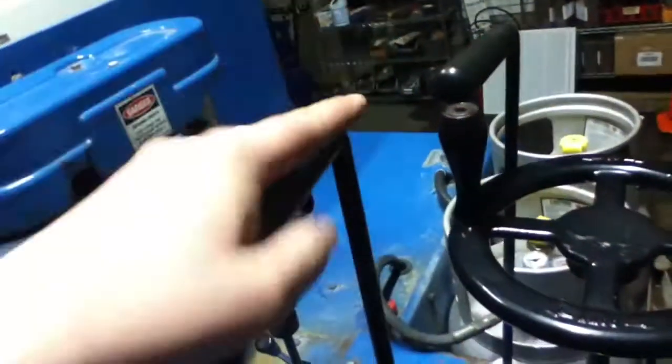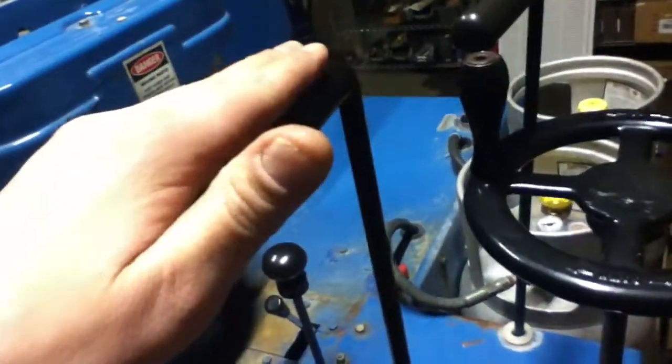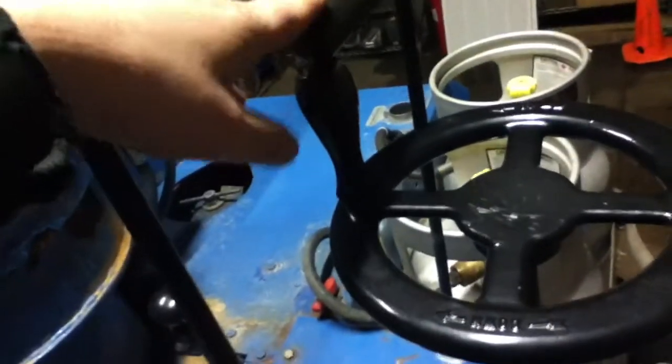And we'll go over here. Let me change my camera angle. We have a series of handles. This handle is your main water. This handle is your wash water. Your main water comes out in that pipe right there and lays a fresh sheet of water, particularly hot, on the ice after you cut it. This one lays it underneath the deck. It helps melt the skate marks, makes the ice look nicer.